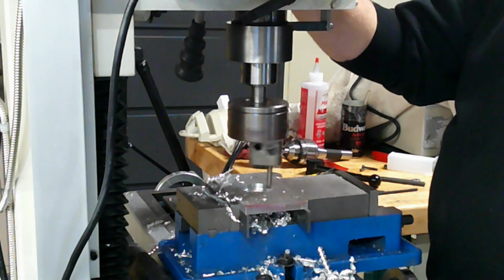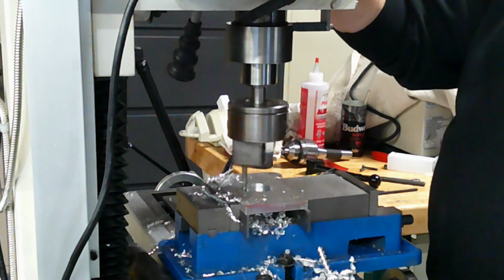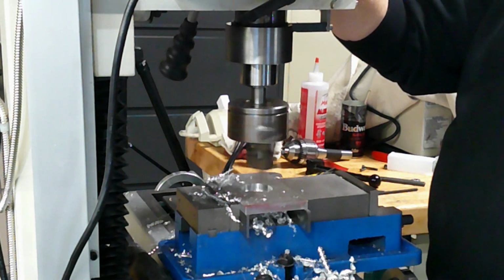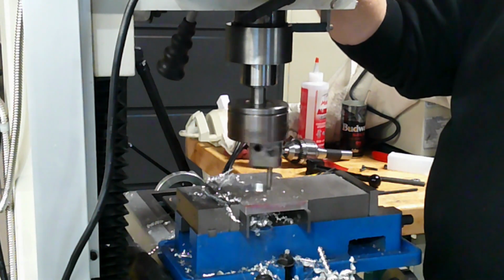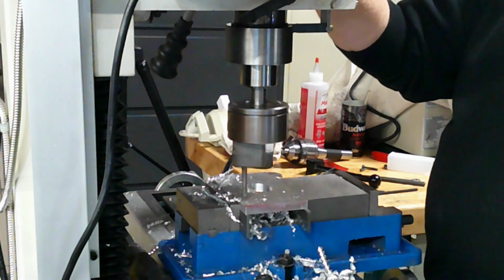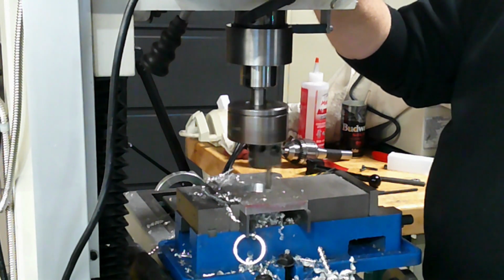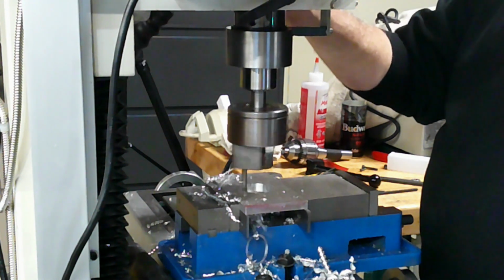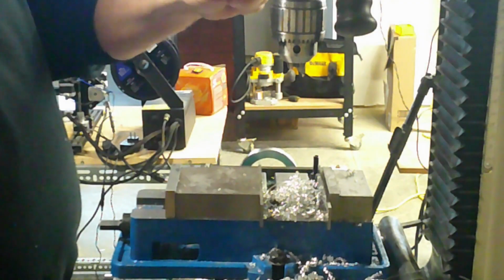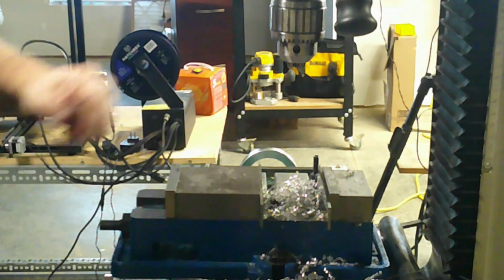I drilled a 1/2 inch hole to start with, and the final hole was to be 1.5 inch on the plus side. I did set up the head to remove about 20 thousandths on each pass in the aluminum workpiece, and measured the hole with the digital calipers after the first two boring operations. After that, I took about 50 thousandths on each pass. The hole ended up being 1.510 inches on my last pass and I stopped the boring operation.